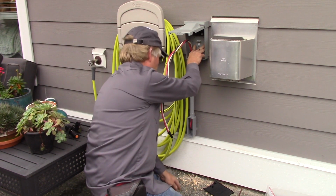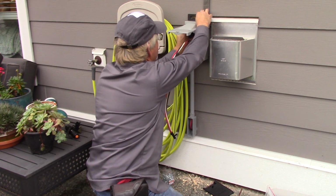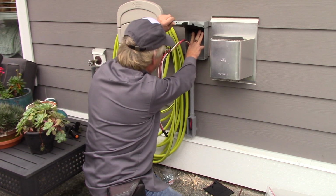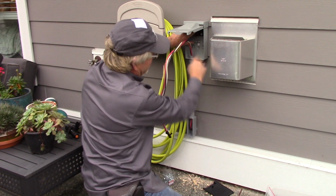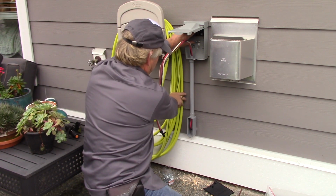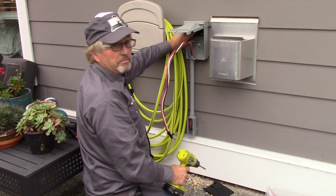So I want to level this, and then I level the box, and more importantly, I want to line it up with that vent for the fireplace, because you know, if my box is level and this may be a bit crooked, it's going to show. So you want to just make sure your space between here is even. And I leveled that conduit earlier, so I kind of marked where this needs to go. So now we just screw it into place.